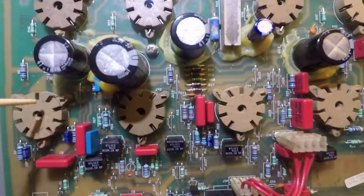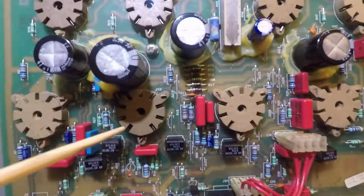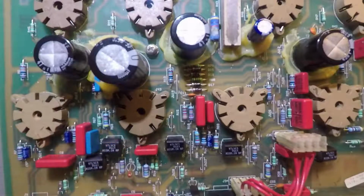We're looking straight down into the tube right now, and in fact, one of the cool things about these sockets is that, if you look closely, you can see little metal tabs in them, and those tabs are really perfect for probing with multimeters and with your oscilloscope, just to see what's going on at each of the pins of the tubes. The sockets are numbered nicely, with the pin number that we're talking about on the tube that's underneath it.